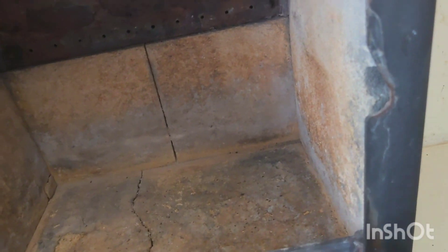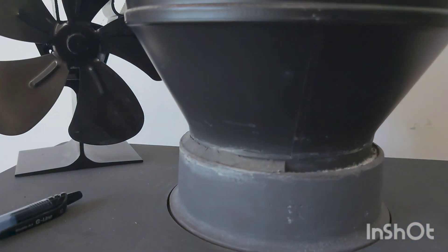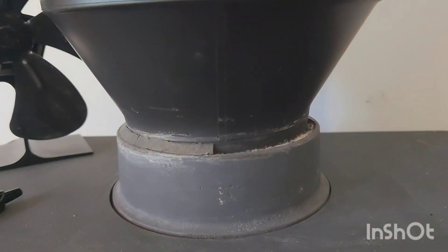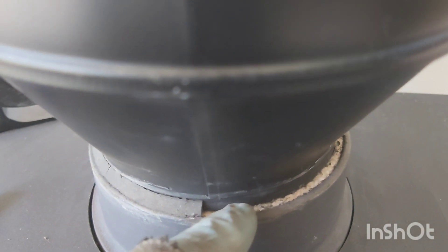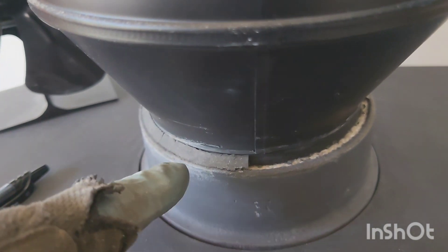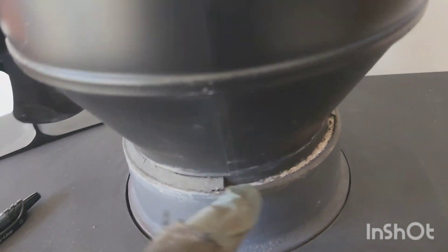Let's give that a brush off and a little hoover. Just checking the old gasket right around the edges — looks all fine, no problems there. I've noticed the fire cement is cracking along the top here, which it's going to do. You don't want to put fire cement on these joints. As you can see, someone's put a gasket there and then put fire cement on top of it, which is really daft. I'm going to say to the customer: when that fire cement comes off, leave it — it's sealed with the gasket, they don't need the fire cement there.